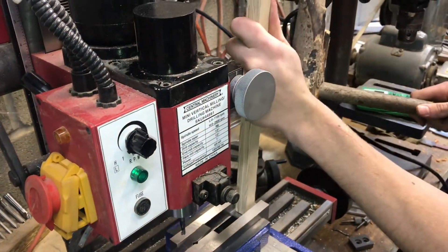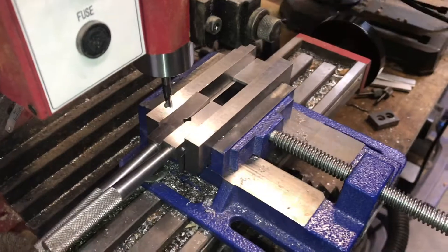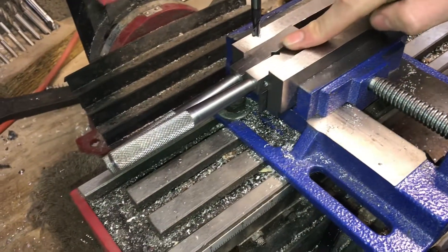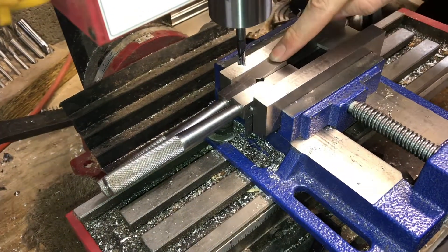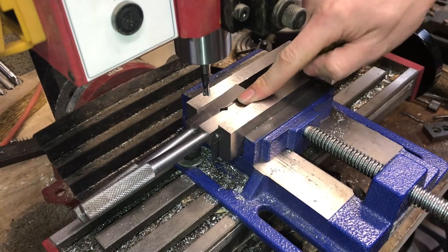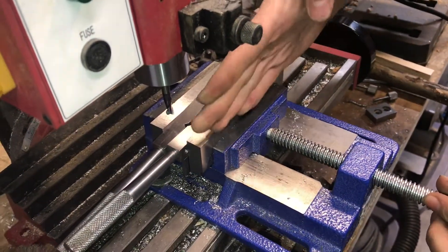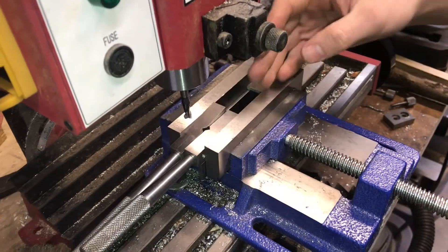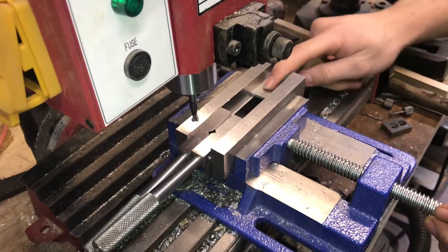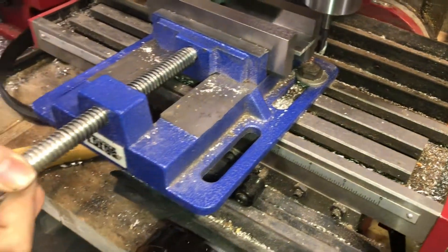If I had taller parallels I might put it on them, but for this I need this piece of wood to get in there. I'm going to seat it until these parallels stop moving. On the other side of my vise I have my tap wrench disassembled. These are ground down to one half of an inch each, pretty precisely. Because this part is one inch wide and together these are one inch wide, it stabilizes the vise — my adjustable jaw without these in here can wobble back and forth quite a lot. If there's only pressure on this side of the jaw the whole thing will angle and give me a really bad grip just on this corner. When taking our pass along this edge we'll be using this knob which we had locked at the beginning.